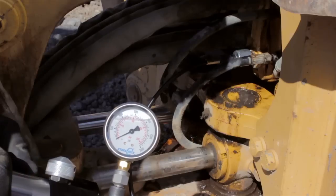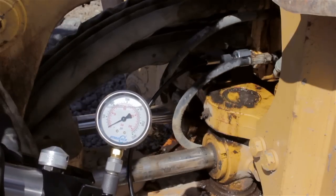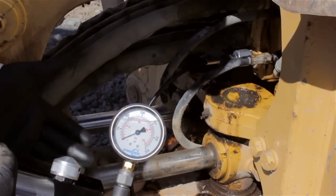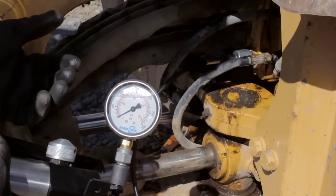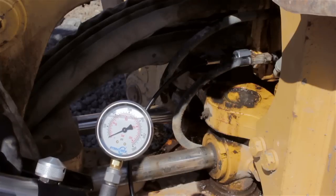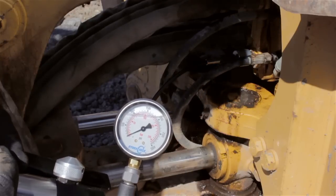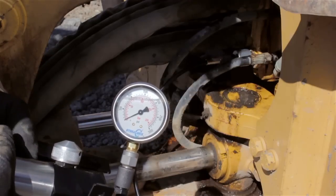What you don't want to do is order a new component, wait a few days for it to arrive, put the new component on the machine, and find that other components in the same circuit are leaking. So we'll run them all down so that if we have to order components or have them rebuilt, when they come in, they'll all be in good working condition. Let's move the test now over to the cylinder — also a non-invasive test.